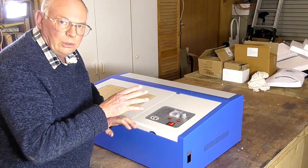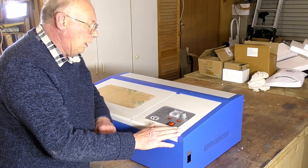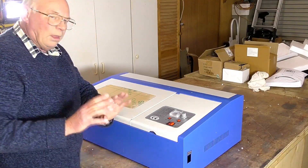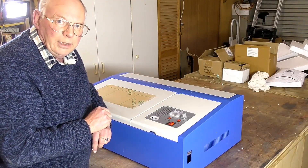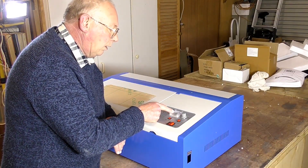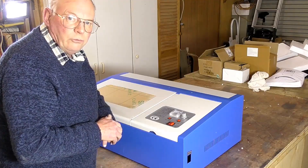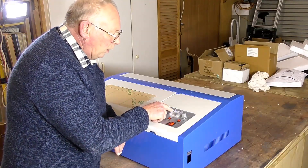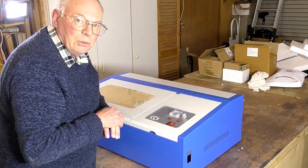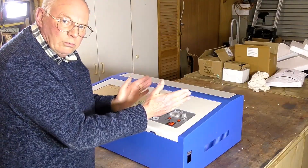You're dealing with quite dangerous voltage here — that will arrest your heart. If there's a leakage in the high voltage circuit or if it's not earthed properly, and that's one of the things we're going to find out, it is possible it can kill you. That aside, this is the one I would recommend for a starter because you have a milliamp meter and a variable control. There are no markings showing percentage — you don't need it really. You go by the milliamps, and if you know the maximum the tube will take is 18mA, you can vary between that max and min.